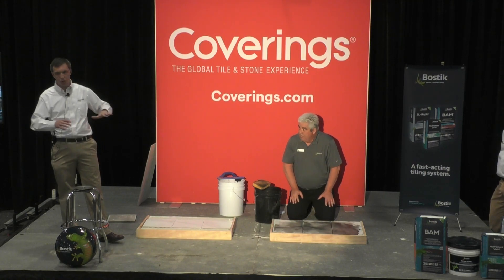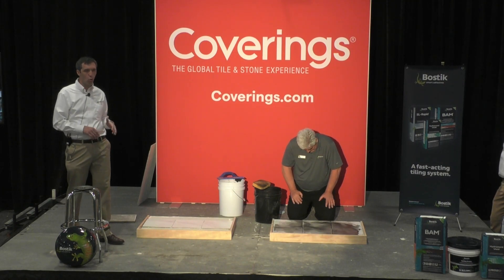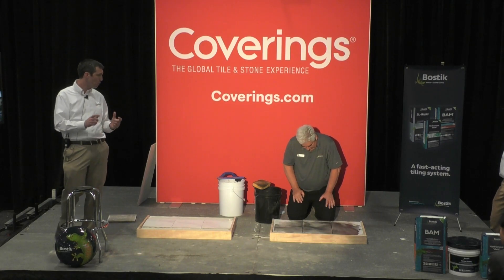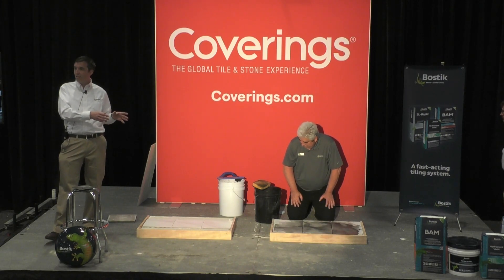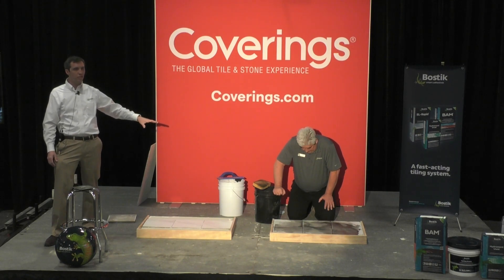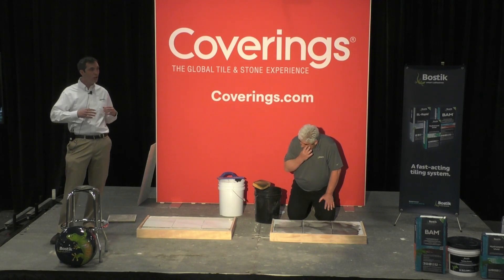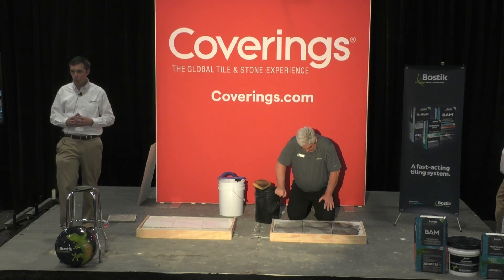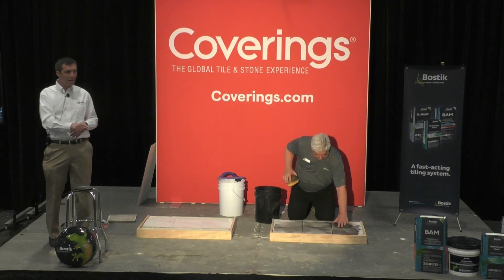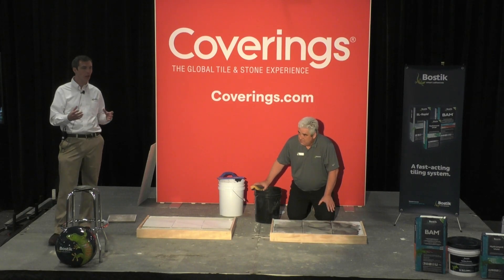With Vivid Grout, generally after the application is done, you let it sit for around 20 minutes prior to doing your initial wash. In this stage demo we're going through that a bit faster. With most fast-setting cement-based grouts in the marketplace, when you see haze like this, it's a troublesome point — you're wondering if you can get it off the face of the tile. This often promotes overwashing the grout, starting to wash it faster than the grout is truly ready for. You let the grout get to the point where you can touch it with your finger and not deform the grout joint itself — that's your indication it's time to start cleaning.